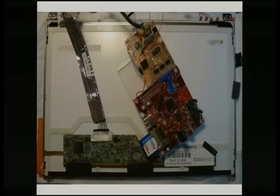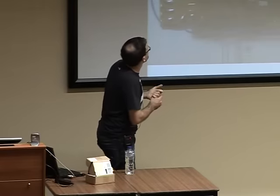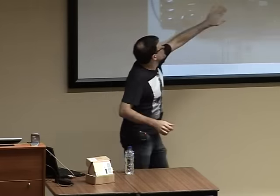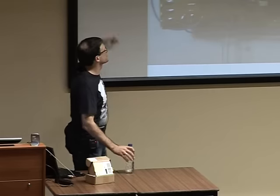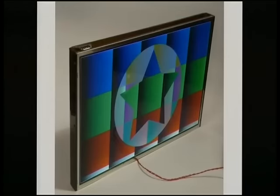The BeagleBoard outputs RGB, well, actually this version only outputs DVI. The chip itself will output 24-bit parallel data for video. So I took the DVI chip off and wired on a whole load of little wires, which will take the data over. You need some good optics for this sort of thing, or see an eye doctor. It's not good for your eyesight. So take it off, turn it into LVDS, which is a very high speed data standard used to transmit data to a lot of flat panel displays, and then send it out. That's the socket for the laptop panel, and I made a little arty useless thing to hang on the wall. The software for this is just showing a test picture.